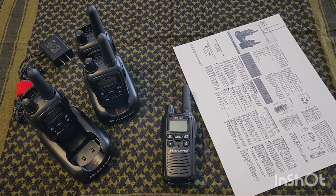These are Midland LXT 600s. They're FRS/GMRS pre-programmed radios. They have your standard channels 1 through 22. They also have channels 23 through 36, which is just a mixture of FRS and GMRS frequencies that Midland has pre-programmed with DCS and CTCSS tones, so you're not really getting any additional channels there — they've just reintroduced a mixture of those FRS and GMRS frequencies with preset tones.